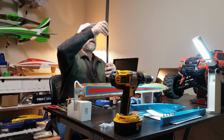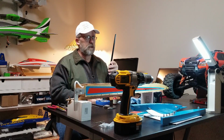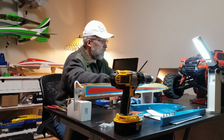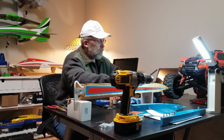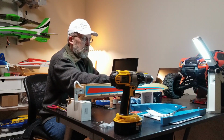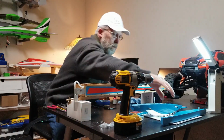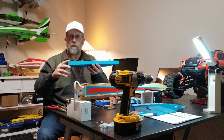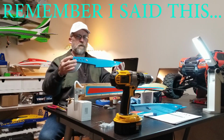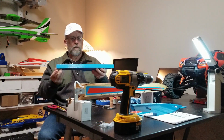So I've made my front rod 5/32 of an inch shorter, and that should get me probably 3/16 toe in. So the toe in measurement will be from the back to the front of the sponson. So I want toe in, front toed in.